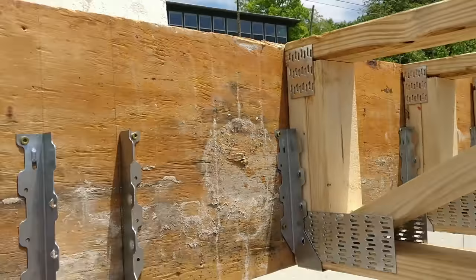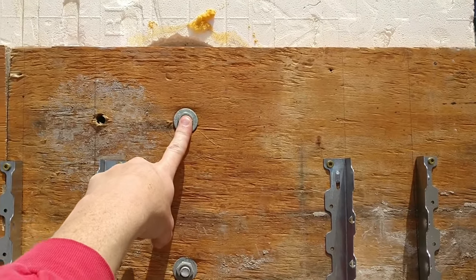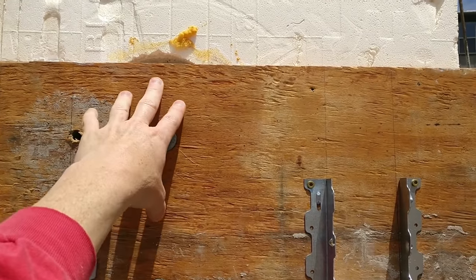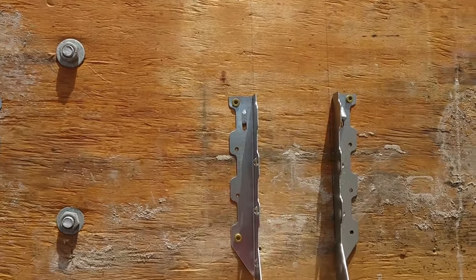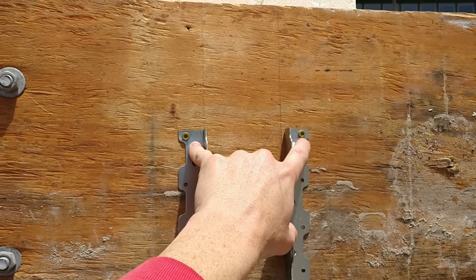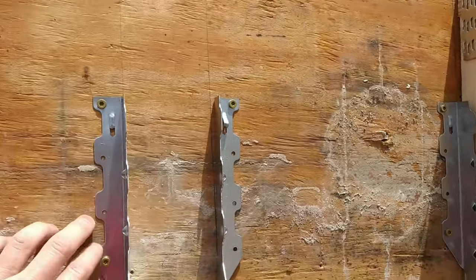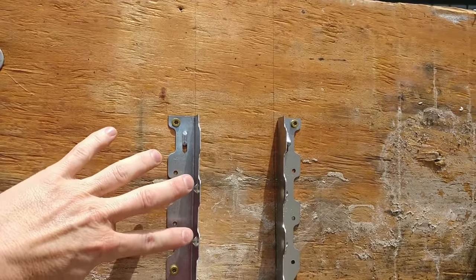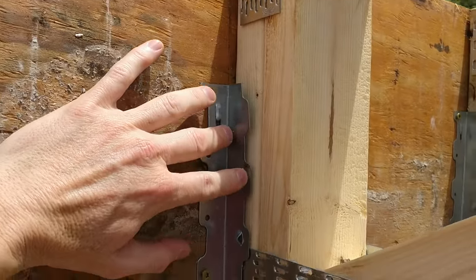Over here is our rim joist, and I just showed you how the anchors come through. After this part, it is just typical wood framing — you drill the holes, set your anchors, and put in your joist hangers. What they've done is start with two screws to hold it and then drop it in like these. Once that's done, they'll come back and use the special nail gun that'll set the nails here, which will go actually into the side of each one of these boards.